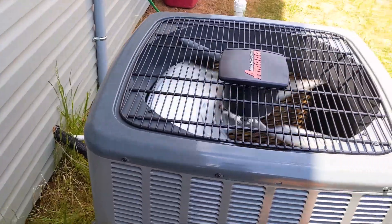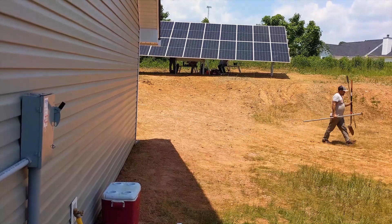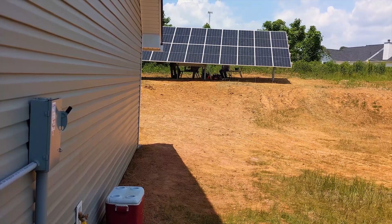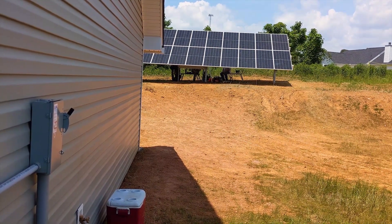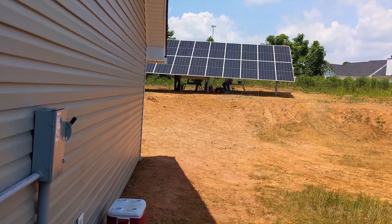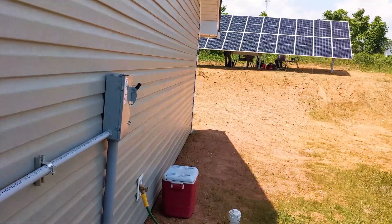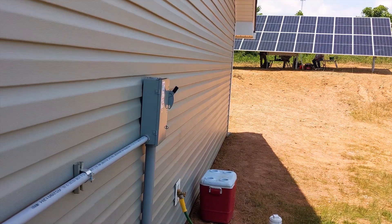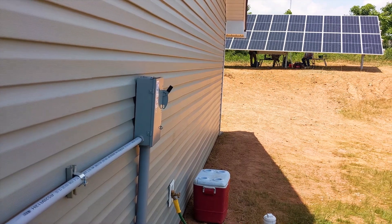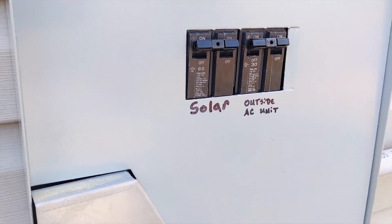This one is just landed in a 60-amp solar breaker, and all of that is below the bus bar rating - doesn't exceed it for this GE panel. Didn't want to put the disconnect behind the air conditioner. We trenched just to 85 feet. We put mobile home feeder 2-2-4-6 up to a GE combiner panel, and that's where the two SMA 5.0s are combined via breaker. Then there's main lugs that we hooked on to come here. So we go main lug to the lugs in the Eaton AC disconnect. Non-fuse, because we have overcurrent protection device here and our 60-amp GE breaker.